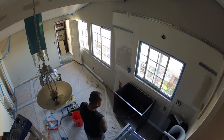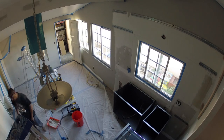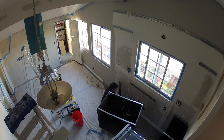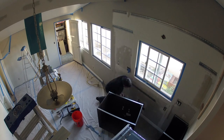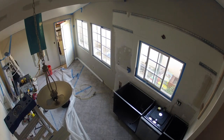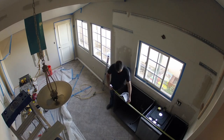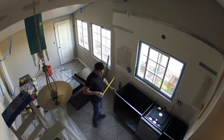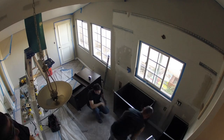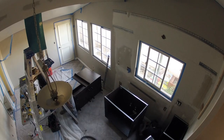Eddie is making good progress painting the whole room, and Neil is working on the baseboard trim cuts. I think Neil also had to run out to a tile store to get some additional supplies. Here I'm attaching and caulking the baseboard trim in the section behind the dishwasher and sink area so it's watertight. I'm taking measurements and comparing them against the plan I made in Photoshop to make sure everything is at the right distances. The cabinet laying on its side here is the corner cabinet that will turn into the peninsula.